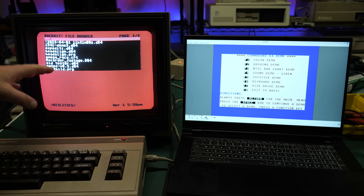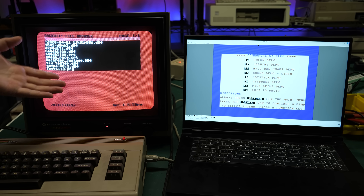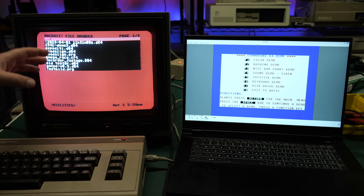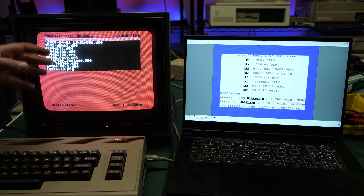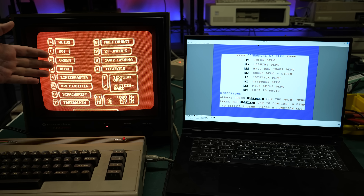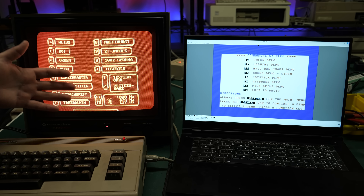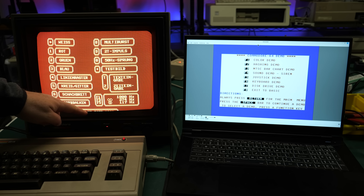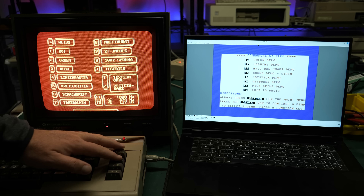I still don't feel very comfortable with these colors, and I don't have a reference image — the best way to test this monitor would be to hook up a signal to the back. So I'm going to try something a little different. I went out and grabbed a couple of color reference programs. There's a few on here, but basically what I need is a color palette. If you're working on a PAL system, there's a really good one called TestBild — that's B-I-L-D. Unfortunately it's all in German and it's meant for a PAL system, so the image appears elongated on an NTSC monitor and goes off the screen.